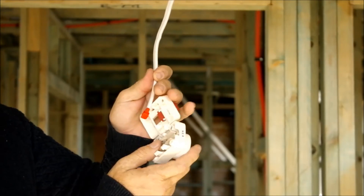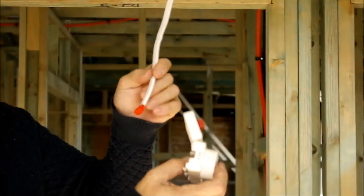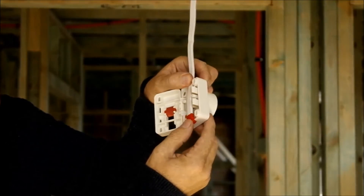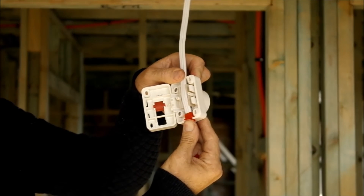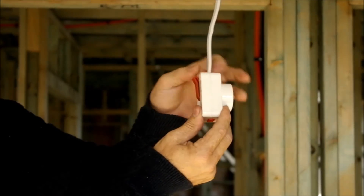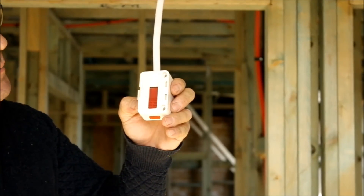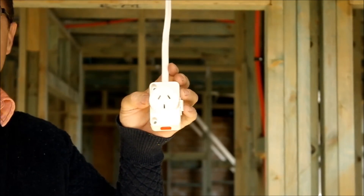With the product set to the 1.5 millimeter side, lay the plug base into the cable guide and ensure that the end termination grommet locks into the edge of the housing. Close the rear housing and rotate the red lever at the back until it locks into position. That's it — that's simple. Less than four seconds.